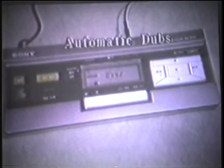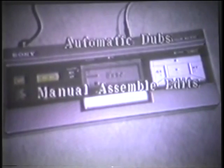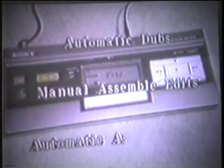To achieve the best editing system, use the CCD V8 camera recorder as the player, an RME100 edit controller, and the SLHF 900 as the recorder. The controller can command any other Sony VCR having Sony Infrared Remote Control System, or SIRCS. This is done by hardwiring it to the Control-In or Control-S jacks on the back of a deck, or using the RMT E1S remote transmitter. Presently, the controller can only be powered by the CCD V8 camera or the new CCD V8 autofocus. The edit controller is capable of automatic dubs, manual assemble edits, meaning one scene, audio and video, edited to the end of another scene, and automatic assemble edits.